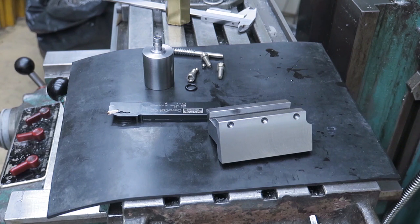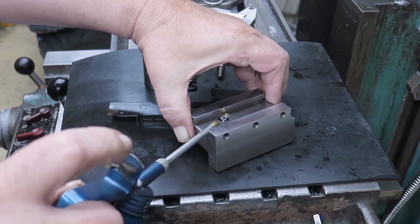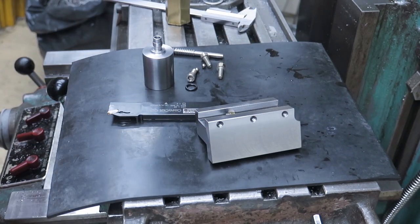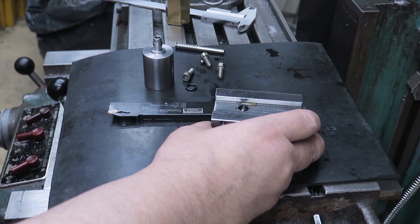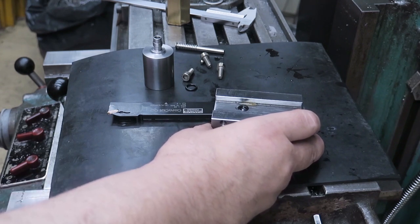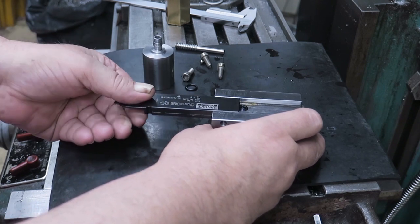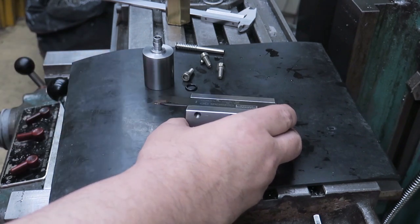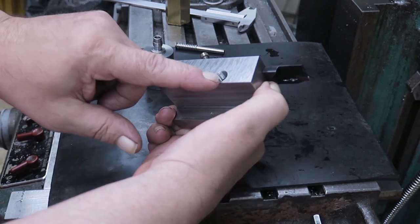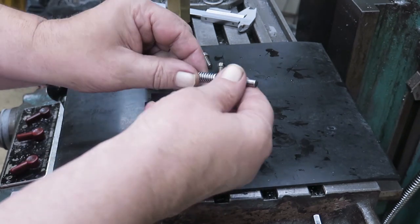And now we need some oil. So the blade goes to there. Yeah, okay, now we have some oil in there. And furthermore, we have a ball in there, like that. That one acts as a one-way valve. And now I just push this there, and it's already quite tight, actually. And now there should be a connection between that hole and that hole. Yeah, okay.